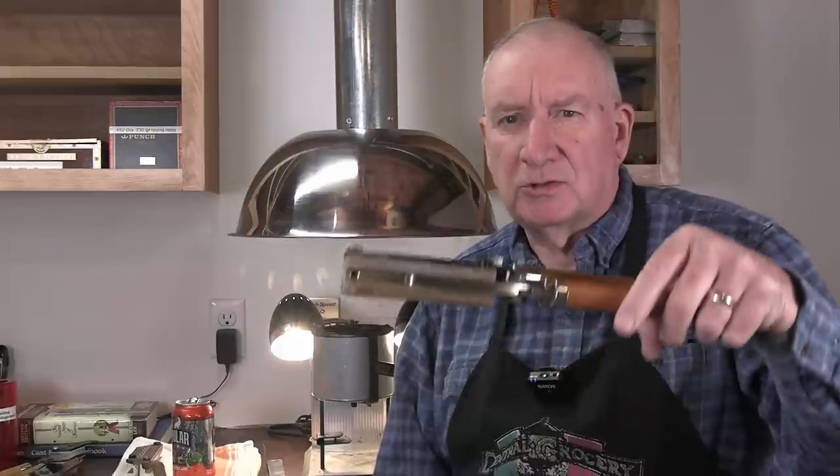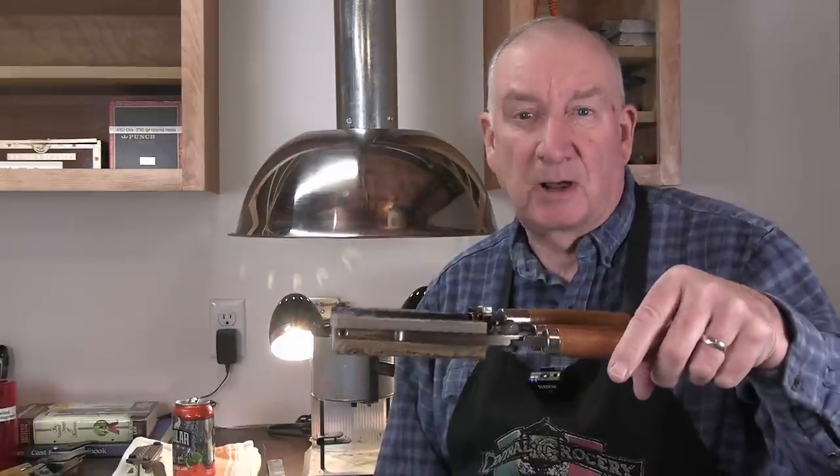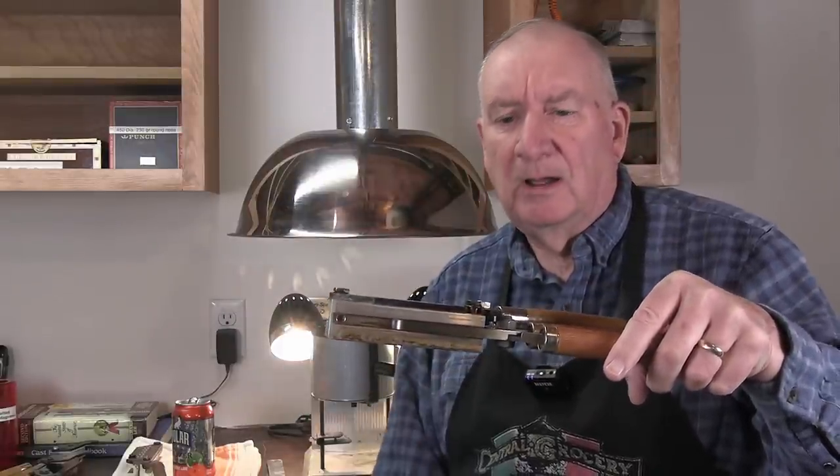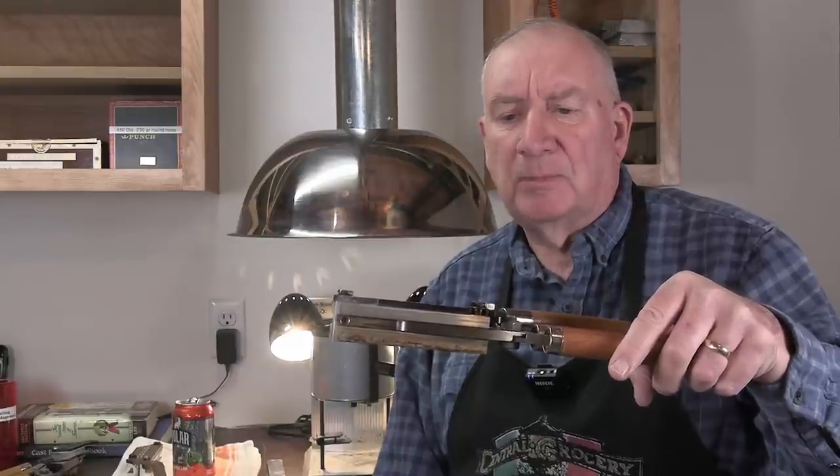The other thing is that aluminum molds heat up very quickly. You can straddle this mold across the top of your furnace to warm it up as the furnace is warming up the lead. You can actually dip the corner of this mold down into the lead. You know the mold is hot enough when the lead no longer sticks to the aluminum — when it just falls away — then you know you've got a pretty close to working temperature.